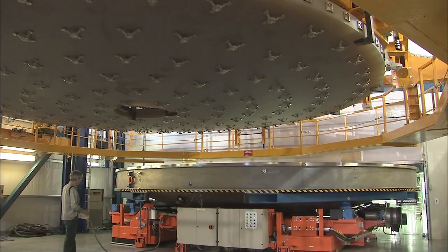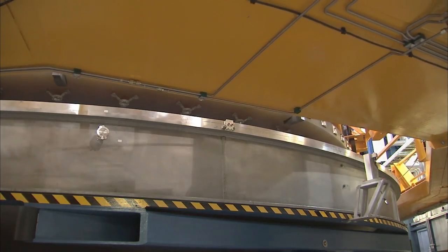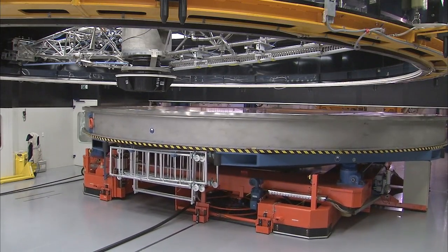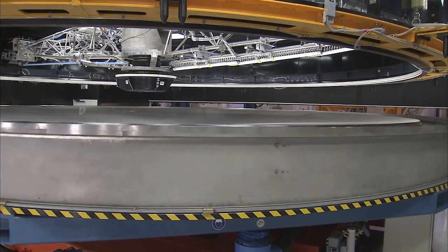Afterwards, the bottom half of the vacuum chamber is brought in and the mirror is carefully lowered into it. The mirror is next taken into a clean room. The first action in the clean room is to treat any badly polluted areas on the mirror manually. This requires a steady and skillful hand in order to avoid scratching the surface. The point of doing this is to remove any particles that might not be easily flushed away during the subsequent washing. Afterwards, the vessel holding the mirror is positioned in the washing chamber, where the old reflective coating of the mirror is washed off.